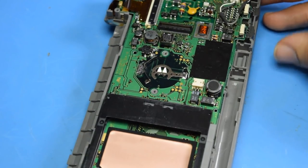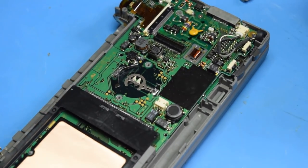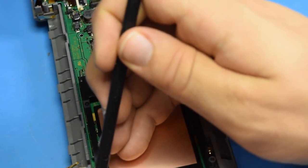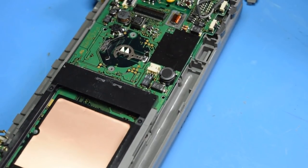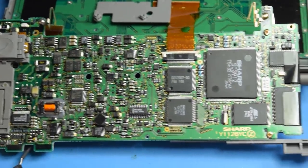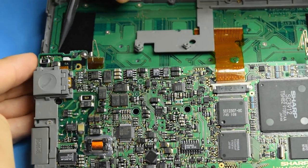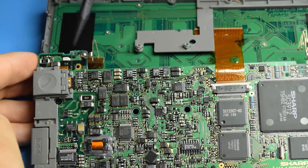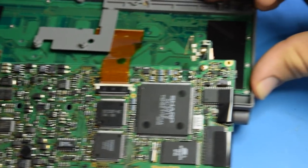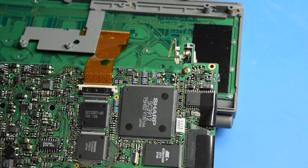Now I can't be 100% sure of that on this side because there's actually two layers of circuit board. You can see the other layer down in there. And I need to remove this screw and this screw, that screw, to gain access to the other side. So let's go ahead and do that now. This is clearly the business side of the circuit board, and it does confirm my suspicions. This contact goes to somehow yet another 5 amp fuse, which would mean it has 10 amps total of current carrying capability. Strange. But this side only has this one tiny little trace coming off of it, which would be perfect for a V-sense. So that will be 1.2 volts.